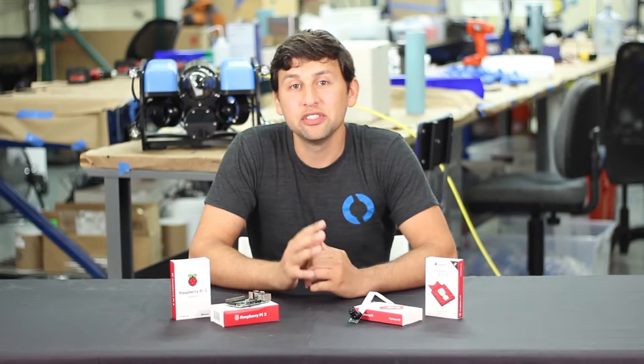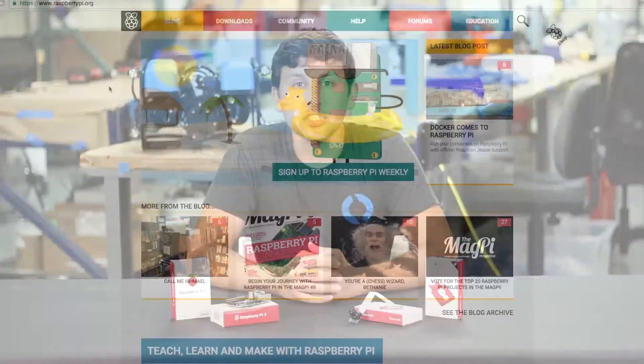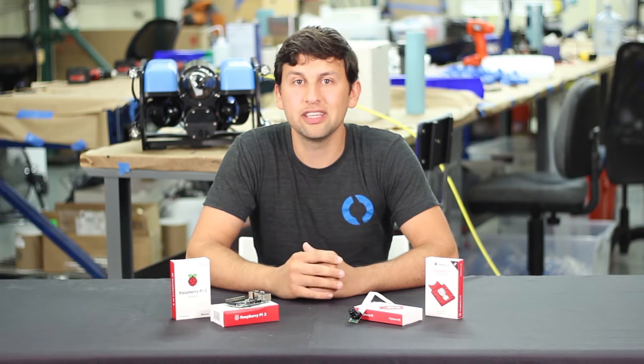The Raspberry Pi 3 is a small but powerful computer with a multi-core processor and a lot of connectivity options. For full details, you can check out the Raspberry Pi website. On the BlueROV2, the Raspberry Pi 3 is used to relay communications from the Pixhawk Autopilot and also to carry the camera stream from the camera through the tether link.